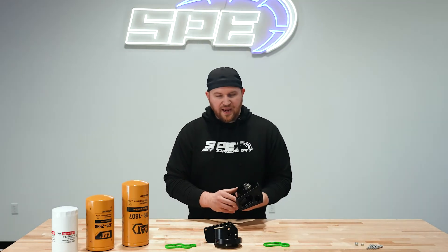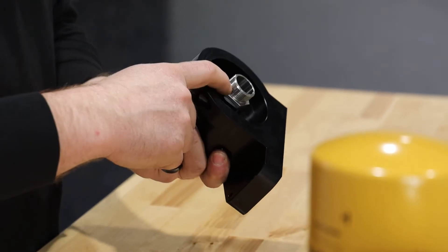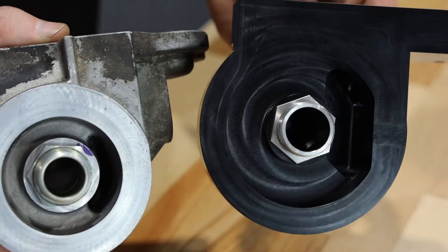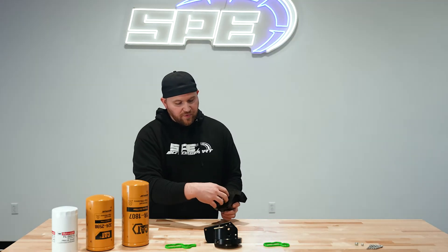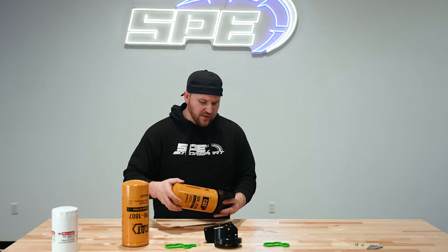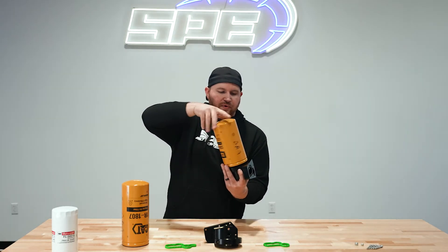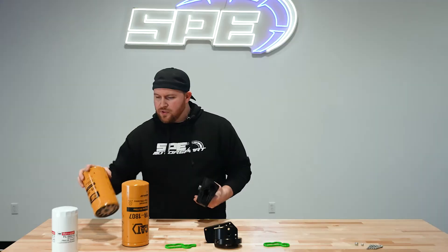Rather than doing an adapter, we wanted to resolve the flow issues and everything else we had found. We use a stainless steel center adapter to screw the filter on with, so you won't have any galling issues. You can see the major cavity — the cavity on the inside is larger as well on the filter side. Stainless steel for the filter adapter. You can see the sheer size difference between that and the CAT filters. One of the major things with utilizing the stainless steel is being able to not worry about galling, so you have a nice thread just like a factory thread.